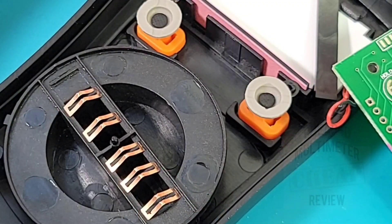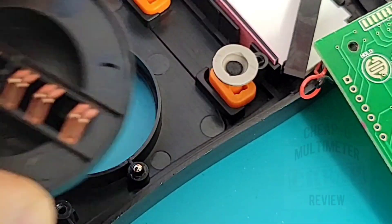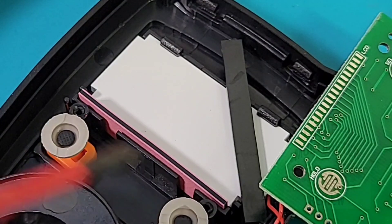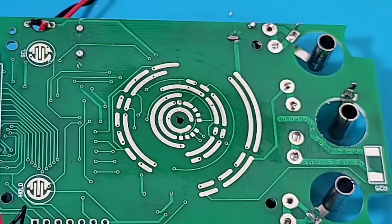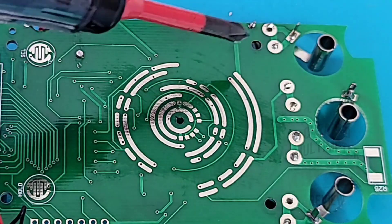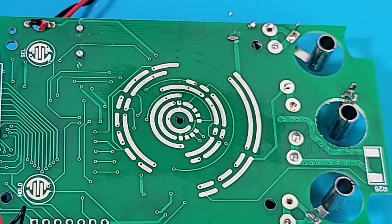Taking a quick look on the other side — here are the rotary selector pads, five of them. This multimeter has balls and springs. Over the top, we have a couple of nice rubberized soft-touch buttons, and of course the elastomer, also known as the zebra strip, for the LCD display. Here are the selector tracks themselves — nice wide spacing, which is always a bonus in the safety department. The soldering on the input jacks is really nicely done. Clean machine, looking good — nothing else to report.